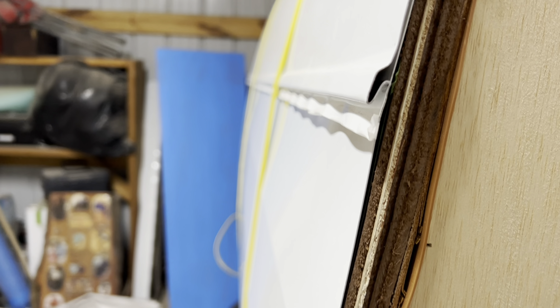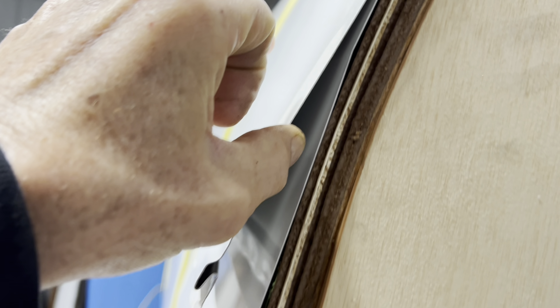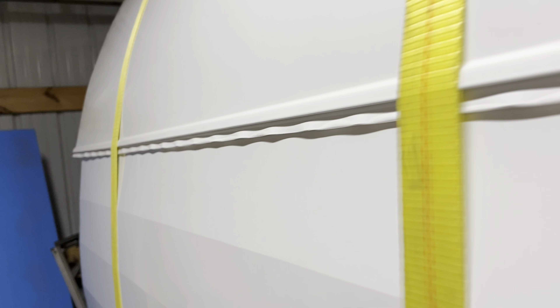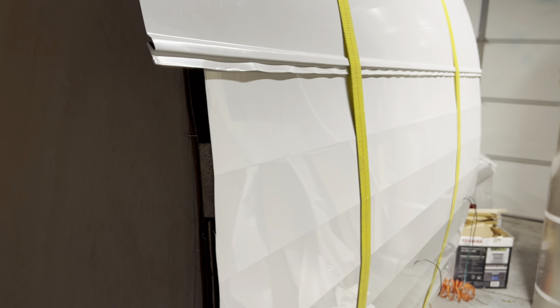Here on the back, I always get it a little extra, so we've got quite a bit extra — but that's okay on the back. I'm going to have to draw my line and then cut this sheet and slip it into there. I lined it up with that side, came over here, and ordered an extra two inches on each end. I set it in place, drew a line with a marker, then took the tin snips and cut it even with the wall. So it's a perfect fit.